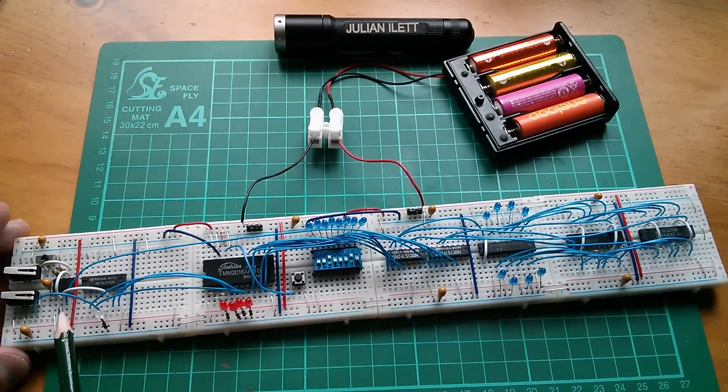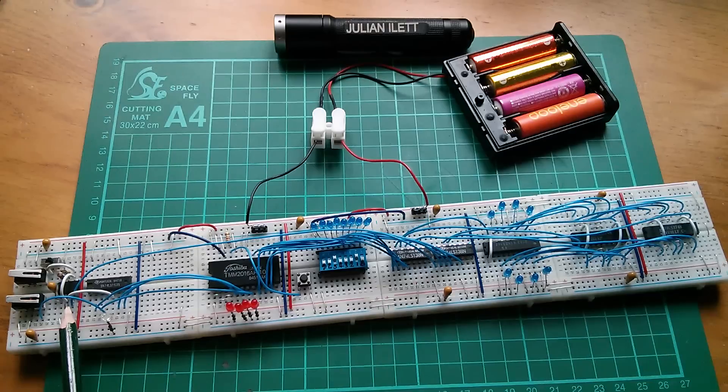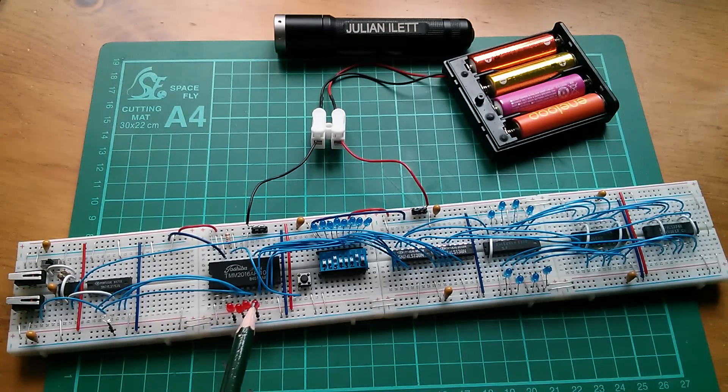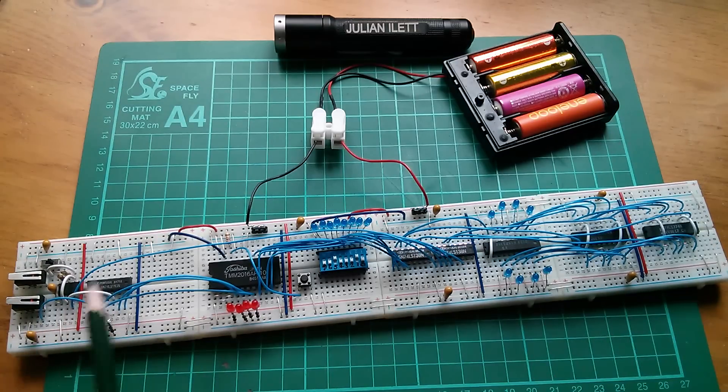There are also one or two issues I want to resolve. Right over here at the clock, where I've got this switchable single-step and free-running oscillator with this little slide switch, something weird was happening when I left a capacitor between pins 1 and 2 — even a very tiny capacitor of 220 pF. I was just getting jumps and glitches and it wouldn't single-step reliably, and I couldn't quite understand why. So I'm going to do an analysis of just the switch and the 555. I'll probably keep the counter there and some LEDs so we can see the count, because if it jumps two or three counts instead of one, you know there's an issue. I'll look at that 555 circuit in a video on its own and do that with a full schematic of what I've done there.